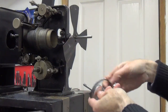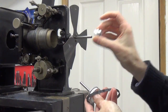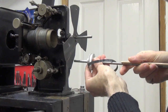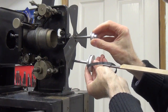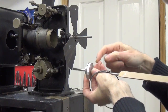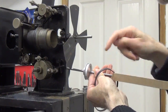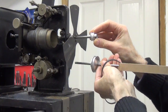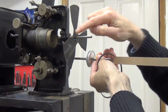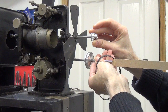For the colour wheel, I want this small pulley to go on here — it doesn't at the moment, I've got to get it drilled out. Then there will be a shaft somewhere around here, driven from that by a toothed belt. On the front of this shaft will be the colour wheel. I want these two pulleys to be fairly close together, to get the shaft about there, so that the colour wheel doesn't have to be too big to cover the lens properly.